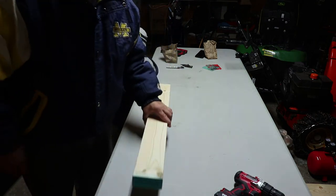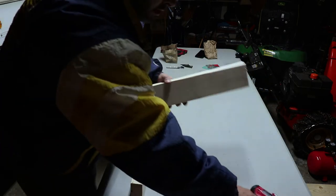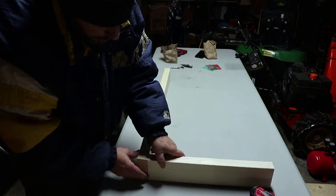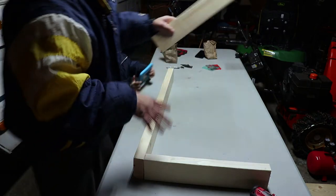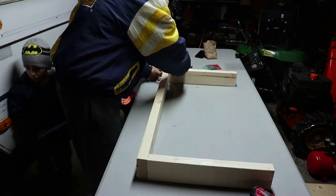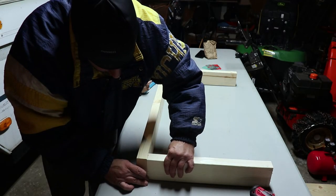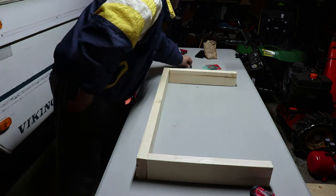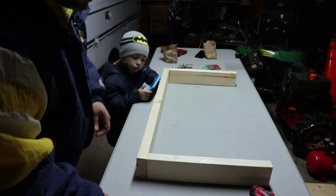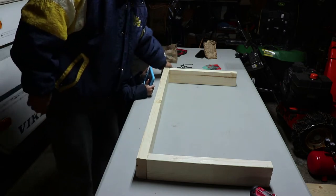So, once again, two more basic pilot holes. Then I wanna take this right here like this. I take the two 17.5-inch sidewall boards, and I just put them up against here like this. One more here. I'm using drywall screws, it's just easier. The wood screws are more expensive too. So just two-inch wood screws on the bottom for the corners.